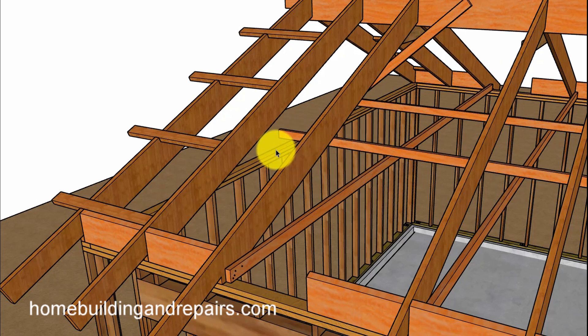This will prevent the walls from spreading apart, and they can also be used in the opposite direction right here. You can see here that they're 48 inches on center, but these over here don't have to be — sometimes I've seen people just run one right down the middle. Rafter ties can be made out of two-by-fours for a 20-foot garage; they might need to be two-by-sixes or larger for longer spans or different roof types — that would be up to your engineer. Most rafter ties we used were two-by-fours, 48 inches on center, and usually would have some type of a vertical brace connecting to the ridge or rafter to prevent sagging.